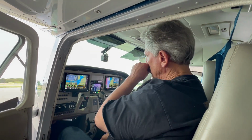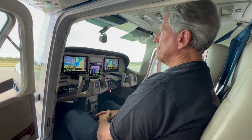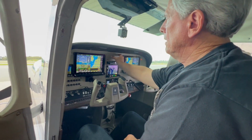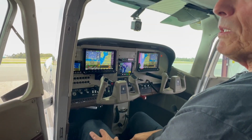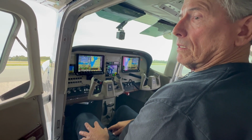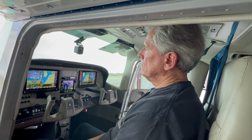So the components such as the remote transponder, the radio, where did those end up? The transponder and the radio are actually sitting right behind this blank panel, and so I can access them just by removing the blank panel. And there's a snap ring, so to speak, a spring clip type installation where they lock down with that spring clip. You just simply move the spring clip away, pull it toward you, disconnect the D-sub connector, and you got it. Did you end up using one of Dynon's pre-made trays for that?